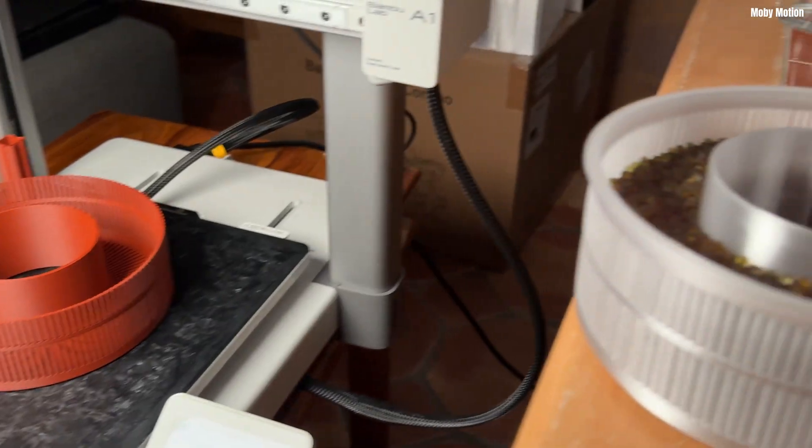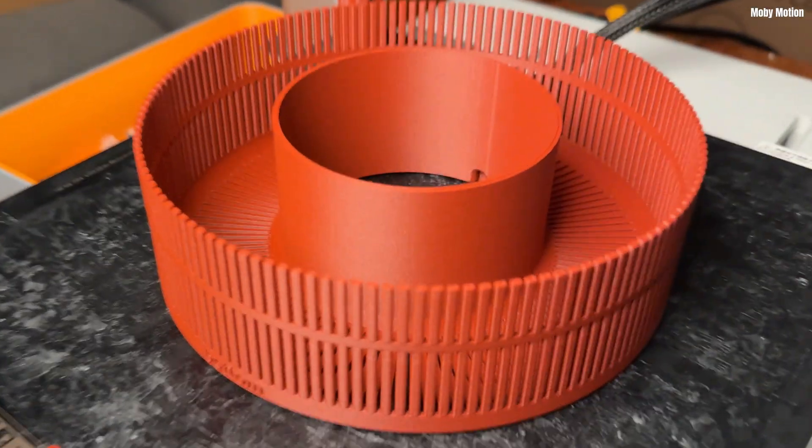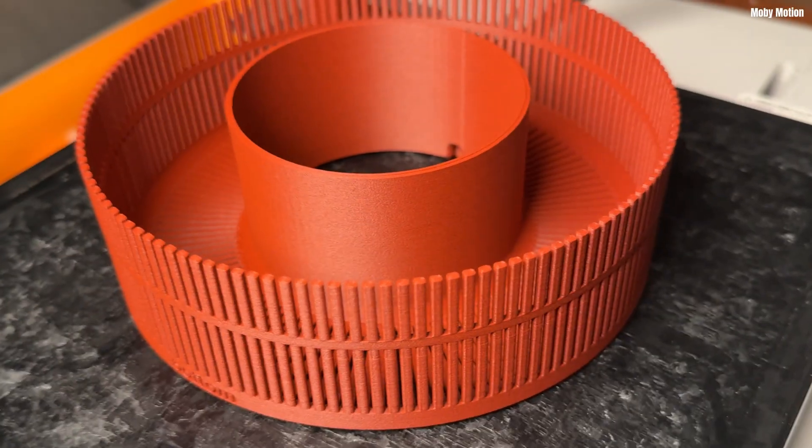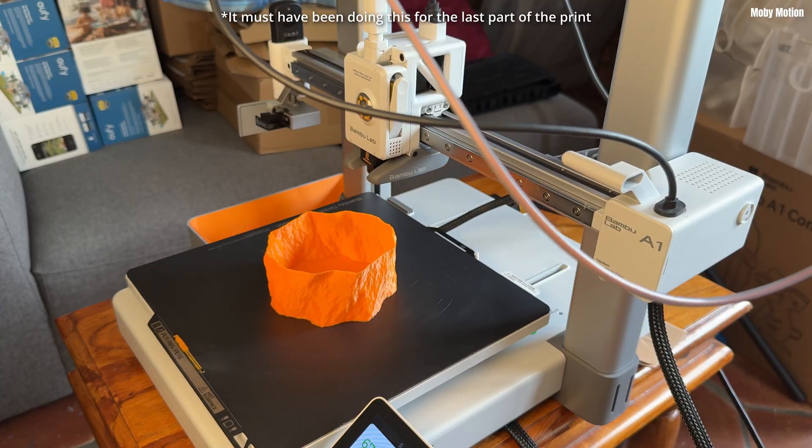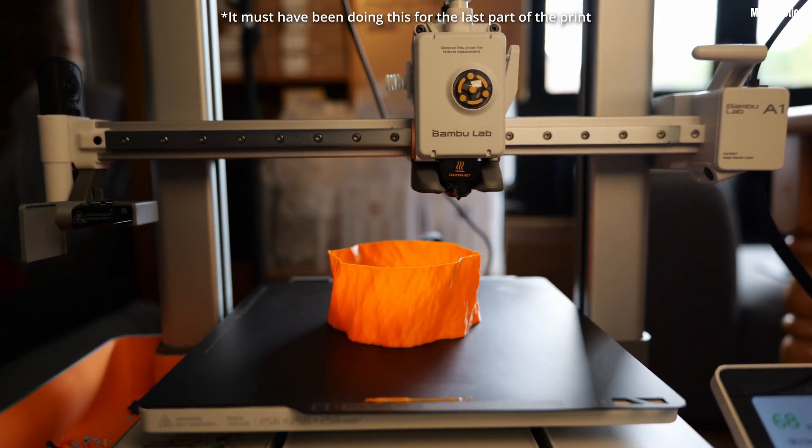I fixed the first issue and thought it was going to print successfully overnight. By the next morning it hadn't finished yet, so I went to work and was really excited when it said print successful. I couldn't wait to get home and play with my first fully 3D printed carbon fiber part. The issue was when I got home I realized some of it was missing. I had the same part printed in translucent PETG to compare, and the carbon fiber part was missing the top like 10–15% of it. I had taken a short video of it in the morning and when I watched it closely I could see it air printing — the nozzle was above the part itself — and I wish I had paid more attention earlier.